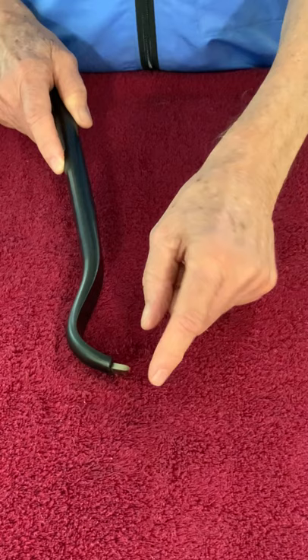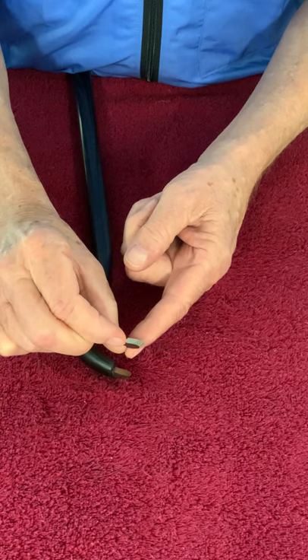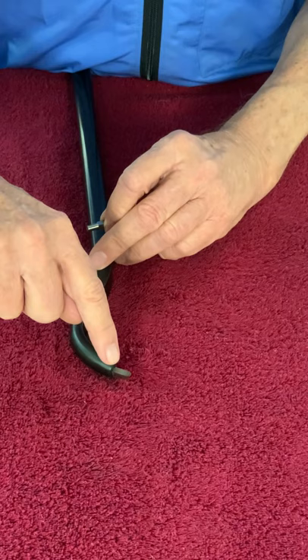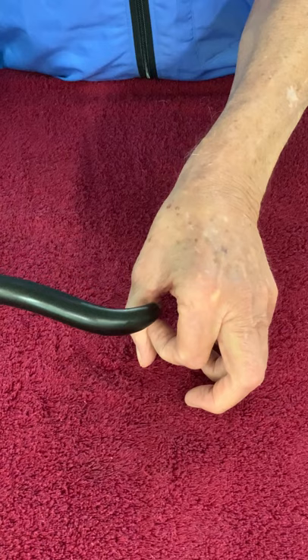It's just a little scraper — that tip has a burr on the edge just like a typical scraper. The cutter is ground back on the sides, has a fingernail shape, and the hook tool cutter is rounded on the back. This tool has a small hole so the steel can be as slim as possible, which allows the tool to reach inside a small opening.